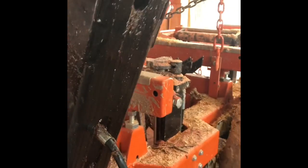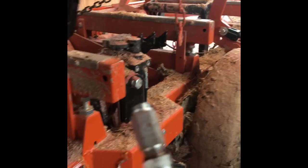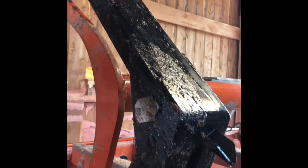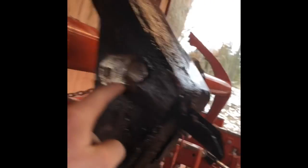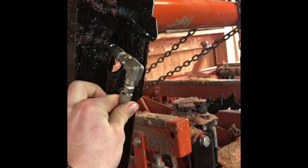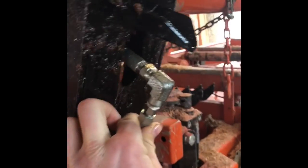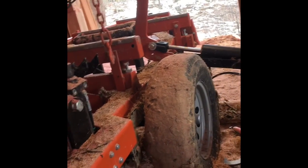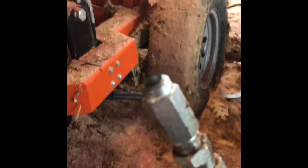Here's the problem on the loading arms of the sawmill. This is the bottom hose — the fluid that goes into the bottom of the cylinder to push the arms up. It's the one closest to the ground. This part sits on the ground and acts as a stabilizer, and then the cylinder pushes against it and raises up the loading arms to put a log in the middle. This is normally connected, and there's a little metal brace that would normally prevent what happened.